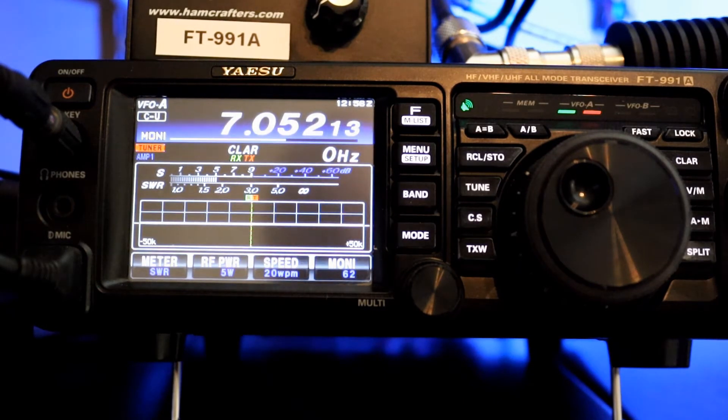These clarifier settings can be used for all modes; I've demonstrated in CW but it works in all modes. In summary, there are three settings: Receive (RX), which provides changes to your receive frequency only — useful if someone comes on who's a little off frequency and you want to tweak them in. Transmit (TX), which changes your transmit frequency only — useful if you're working another station working split, as a quick workaround to the split function. Finally, Transmit and Receive (TRX), which changes both frequencies simultaneously — personally I don't see much use for that one, as your main tuning knob does the same thing and is easier to get to.